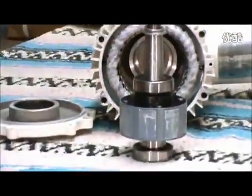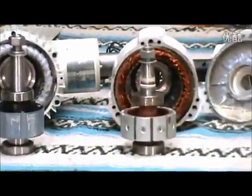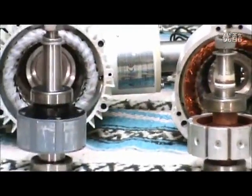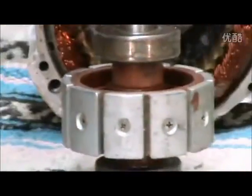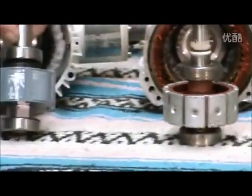Now this is the SkyMax rotor, and this is the Gudcraft rotor. Keep in mind, this is supposed to be 600 watts, and this is a 400 watt wind turbine. You see how clean the SkyMax is? Now, the Gudcraft rotor — the magnets are screwed on, and this is actually a bad design. On the SkyMax, they're all embedded. These aren't glued; they can't ever come out.